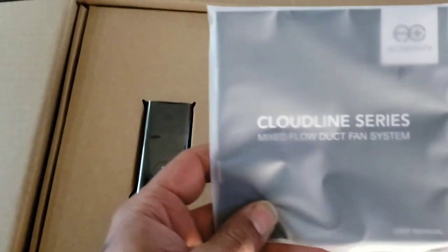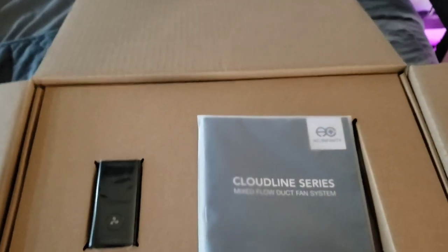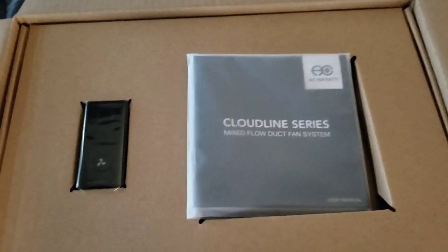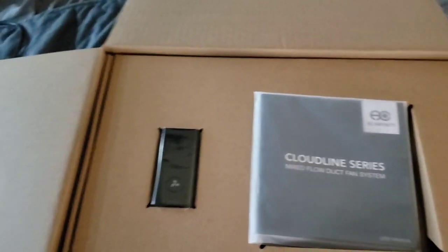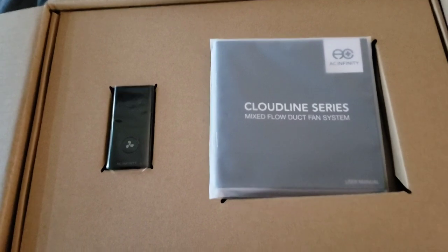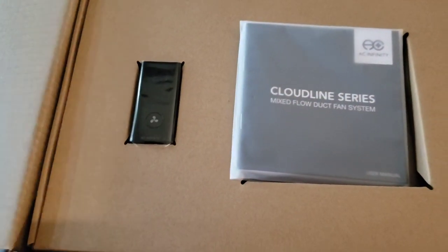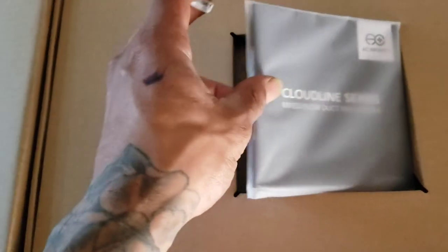The manual covers how to actually calibrate these controllers, because they can sometimes slip off. You need to calibrate them every once in a while, especially the humidity sensor. You can calibrate the humidity probe using a Boveda pack — say the 65 RH pack. Put it in a freezer bag, put the probe in with it, and let it sit for a minimum of six hours. Whatever reading you get, adjust it to 65 because that's exactly 65% RH.